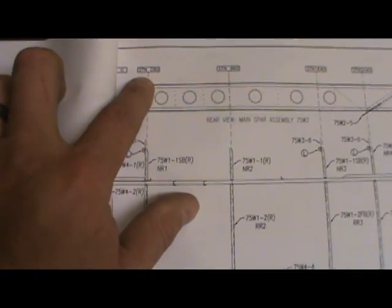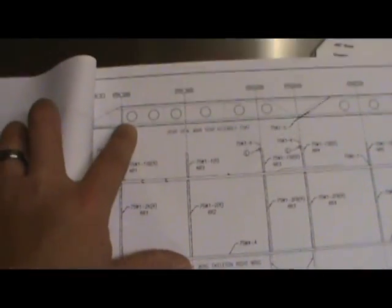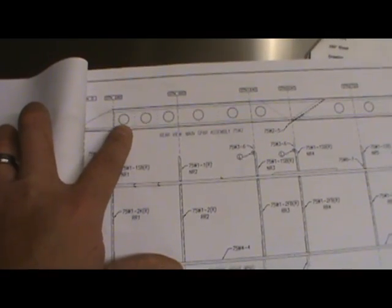I'll do the exact operation in reverse, and I'll have my spar web to start with. At that point I'll start laying out my station lines called for in the plans and doing my lightning holes. I'm extremely happy with how this just cut. I've got this wing spar, and with this material there's another long piece of spar for the horizontal stabilizer that's a little shorter, and I'm going to do that as well — get those cut so I can move on to bigger and better things. Thanks for watching. I'll be back in a little bit.